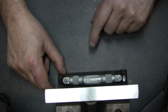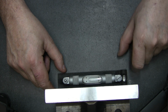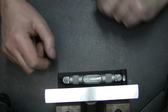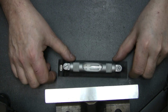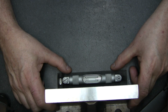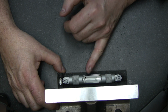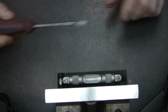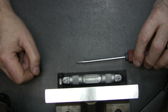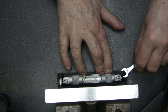Okay, we're not there yet. We have to check the opposite side. If we go on the same side every time, we're pretty well off. I mean, we're not on the leveled angle. We're close to that. Let's say we bring it again to half the distance. We were on this direction before, now we go the same distance in this direction. We go half the distance. I'll try not to move the angle plate this time.